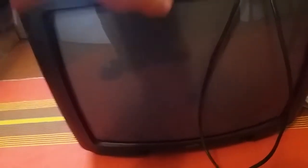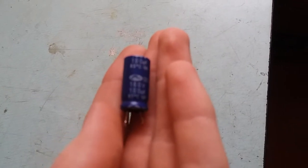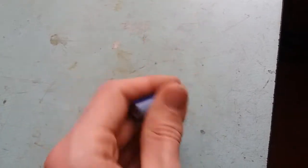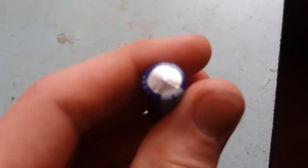So I popped the cover off and decided to check it on location. I went there, popped the cover off. This is a B-plus capacitor, 100 microfarad 160 volts, and I saw that it's vented — it bulged. You can just about see a crack.